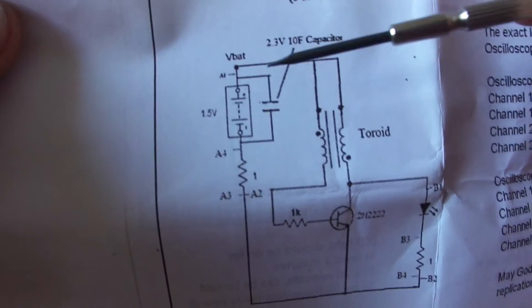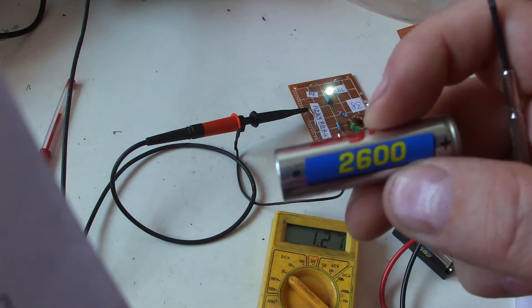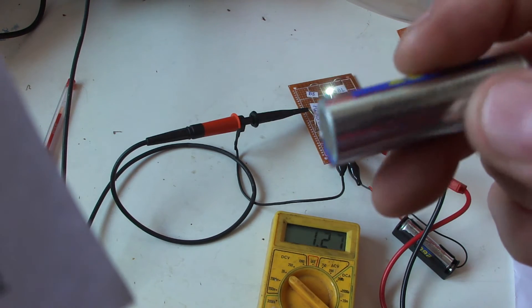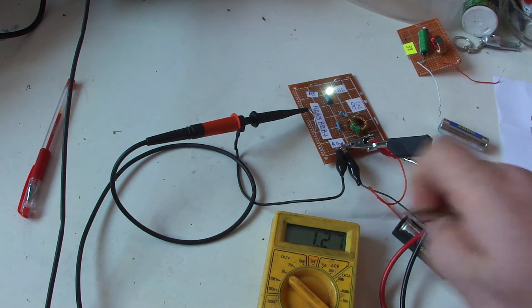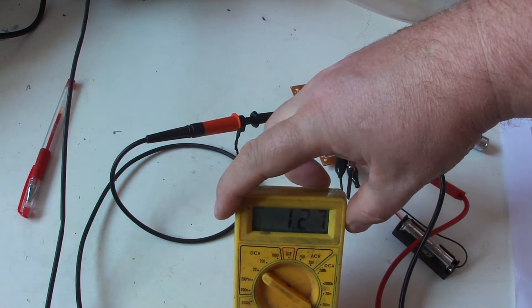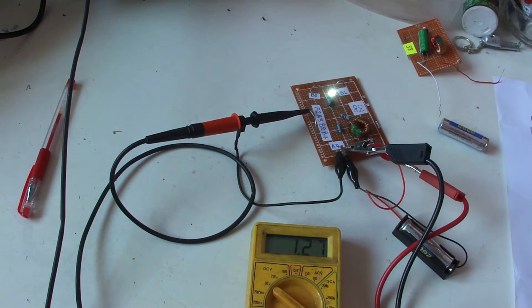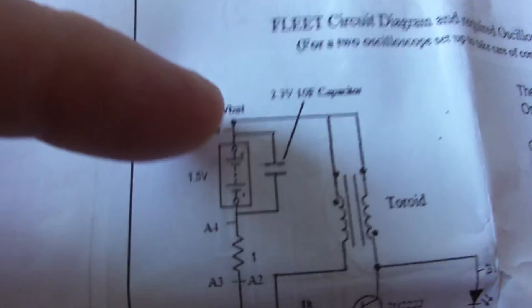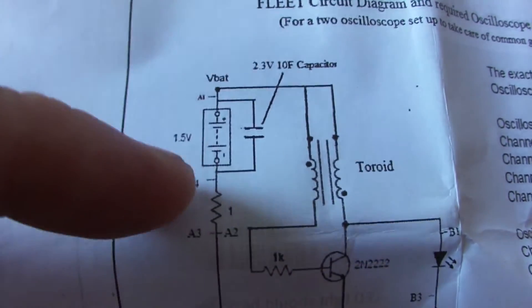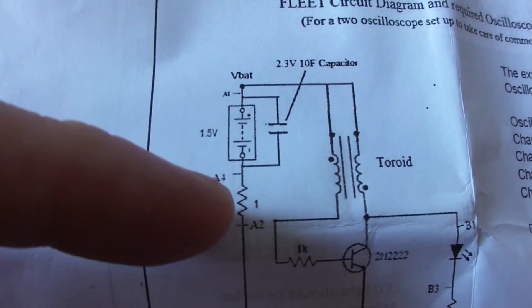Let's see — I have here my battery, it's 1.2V, a 2600 mAh nickel metal hydride. It's now running at 1.27 volts during circuit operation — you can see the LED. We do a test: the voltage of the battery is 1.27 volts, and now we'll show you on the scope the current on the 1 ohm shunt and then we will calculate the input power.